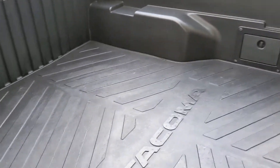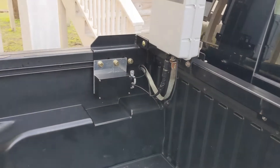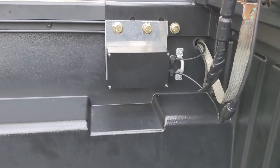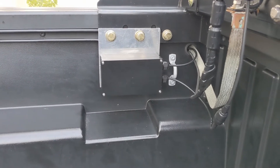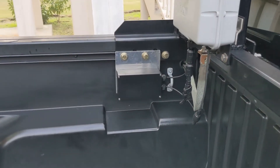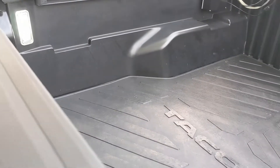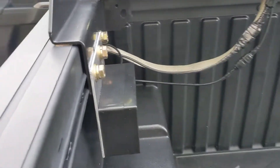Just want to make a quick video to show you what I've been working on as I strive for perfection in this mobile HF setup. In that black box right there, I've added over the last couple of weeks a common mode choke — nine turns on three Mix 52 FT-240 cores. At the antenna feed point it definitely works, that's for sure.